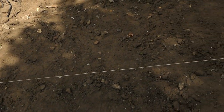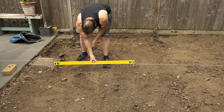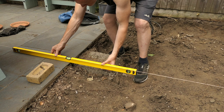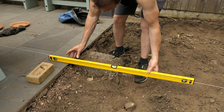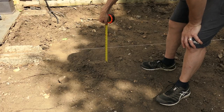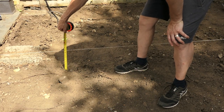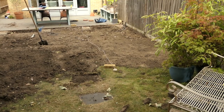Let's make sure that it's all the right height. I've made sure there's going to be a slight runoff and it slopes at a very slight gradient. I'm making sure the bubble on the spirit level is on the line and not actually between the lines. Having a slight slope will allow any rainwater just to drip off onto the grass area. That's about right — that's 15 centimetres. I've made a mess of the whole garden. I hope the grass grows back.